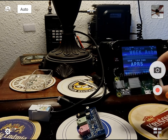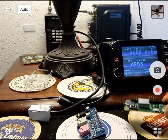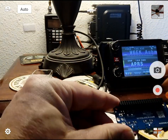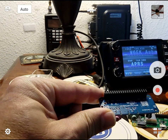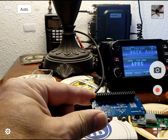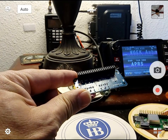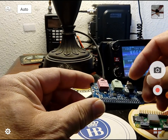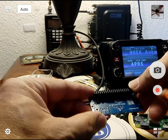This is the Raspberry Pi Zero — about $25. And this is the sound card I really like: the FE Pi Zero V2, only about $14. Buy a bunch of them. It's the same form factor as the Pi — it just smashes right together. You can get it at fepi.com. It implements a line in, line out, and a headphone jack we won't use, plus a GPIO header that we're going to literally smash onto the Raspberry Pi.